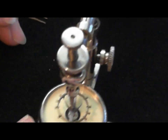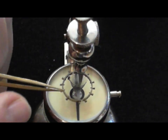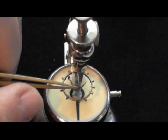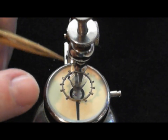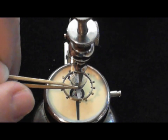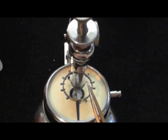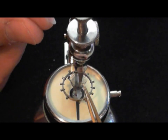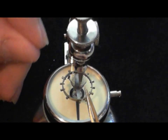Once I've got the perfect position for this hairspring, I could mark this with a red pen — just touch it with a Sharpie so I can see where it is. Or I could just take a ruler and measure the distance. I'm going to mark that position, because when I put this balance back into the balance cock, the stud is here. This is effectively at position zero, which is perfect: 18,000 beats per hour. You want to have the regulator being able to move a little bit — the two pins will slide along this hairspring either on the left or right side of where I've got it pinched, and that'll give me some play to actually speed it up or slow it down later on.